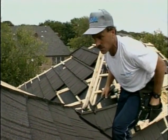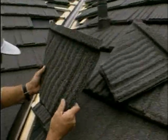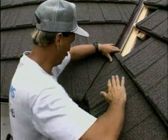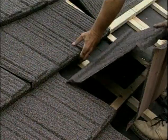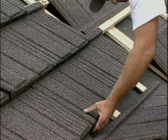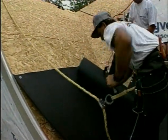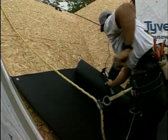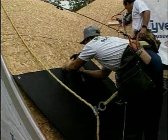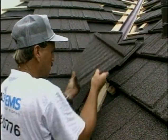How does the roof do as far as resisting moisture? It actually does incredibly well — it doesn't absorb any moisture to speak of. Some roofing materials absorb as much as 15%, and if you're in freeze-thaw country, the water gets into the material and expands when it freezes, causing the material to deteriorate prematurely. Here in the U.S., building codes in most places require felt to be placed underneath the roofing. But in New Zealand, where the steel roof originated, no felt is used — it's that watertight.